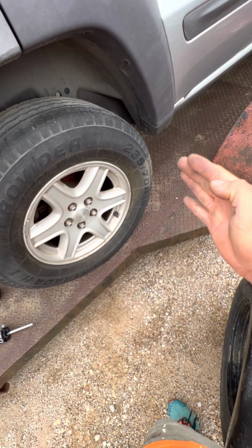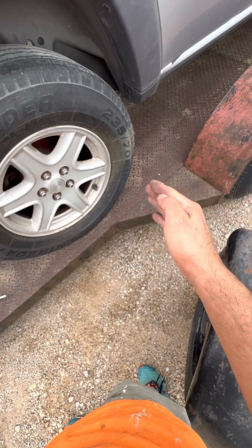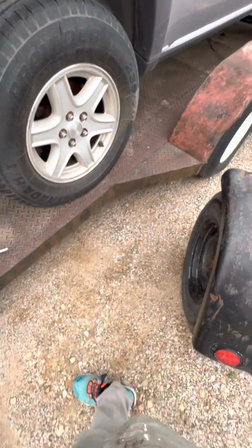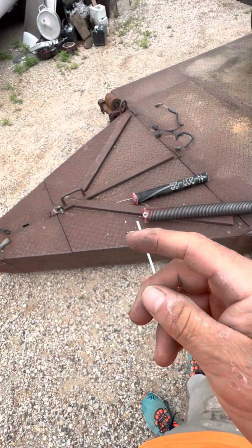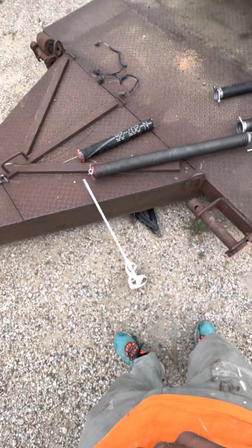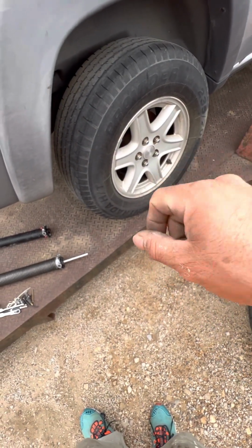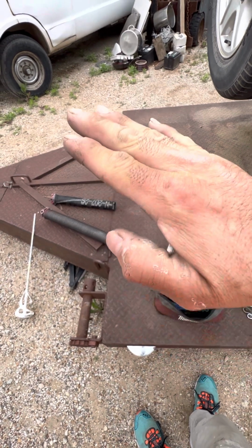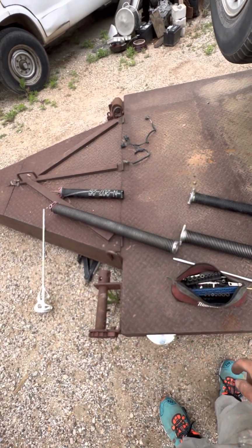Make sure that rope is lined up with the edge. You've got a small opening, and that metal wire has got to fall right between the garage door and the brackets. And so both sides of this garage were rubbing against the doors, and so I had to adjust the right side, actually take it apart and move it over. And this side here, I really had to be careful on how I wrapped the wire around the pulley, because it was rubbing against the door too, which was causing problems. And so I think the initial problem was this side, that pulley, the wire was rubbing against the door, and so it gets snagged, meaning this side had more pressure on it. And so this side was doing more of the work, if you will, as that door kept on getting lower from level down. And so over time, this is the second spring it's broken.